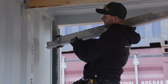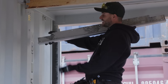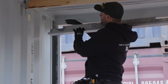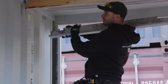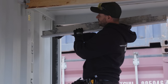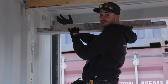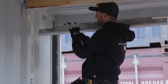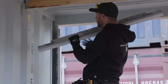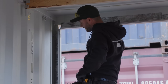There's a notch, and that notch signifies the underside of this casting. You want to line up that notch to that casting in order to get your steel stud brackets and things aligned — if you're utilizing the other components that Container Modification World sells, make sure this is lining up properly. In the instance of a wood stud bracket, if this is installed at the right plane, you're going to take two inches of rigid foam and be able to stuff it right in here and finish up to this nicely. We may need to cut the side piece down — a 3/16 or whatever it's looking like it needs — because container variants can affect the height.